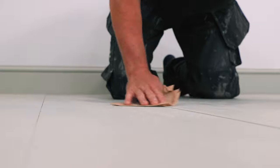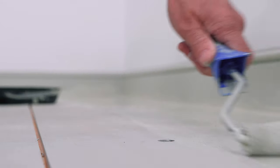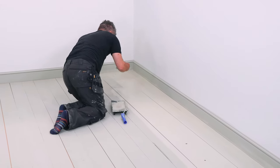Then give it a light sanding once it's dry before you start to apply your second coat. Same rules apply — roll the paint on with your four inch roller and feather it through with your brush, leaving four hours drying time between coats under normal conditions. For more 60 second tips, subscribe to our YouTube channel Mr and Mrs DIY.